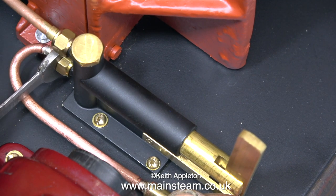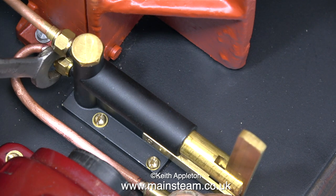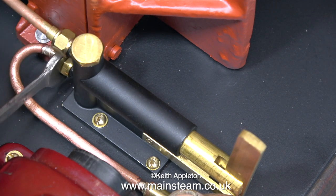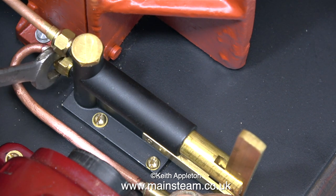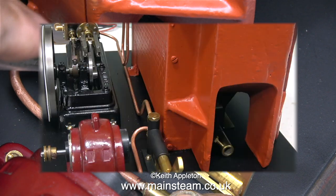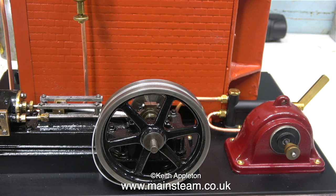I found it, took it into the outer part of the workshop, and silver soldered it to a piece of pipe. The piece of bent pipe, with this fitting on the end, is bolted into place on the pump. The upper pipe on the pump is the feed to the clack valve, or check valve — a one-way valve to allow water into the boiler but no steam and water out. The pipe still needs straightening up and the main steam pipe needs cladding using some string.